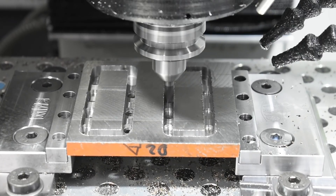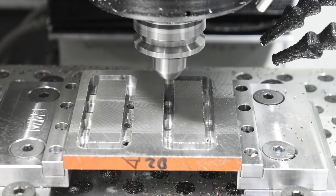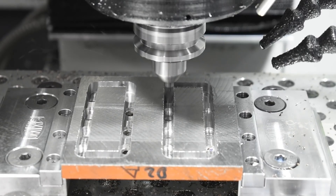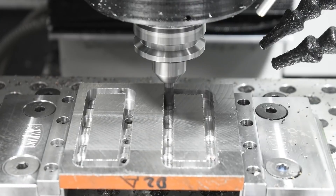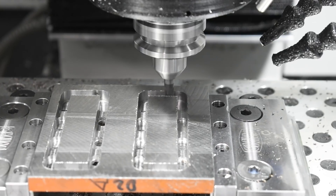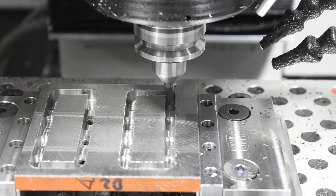I did not see any downsides besides a little bit of added cycle time, but if the trade-off is increased tool life then I think I'd give that up. This technique is pretty new to me because coming from the desktop machines I could never really run a drill — it was all high RPM, low torque, and holes don't really mix. If you do run a hobby machine and want to use this technique, you can always spot your pre-drilled places, take your part off, go to a drill press, drill your holes, put your part back in the machine and it should work just fine.